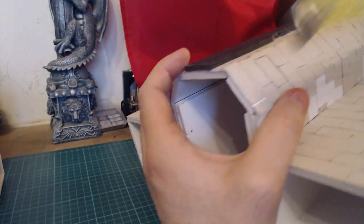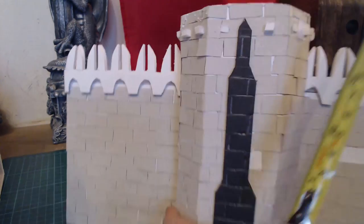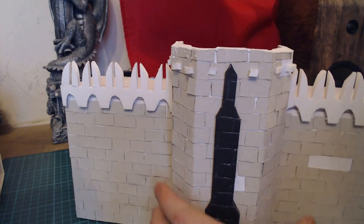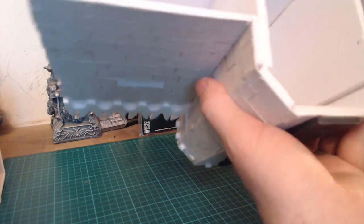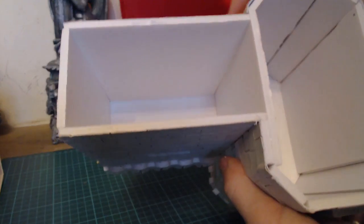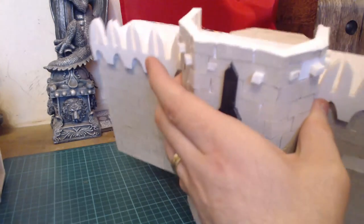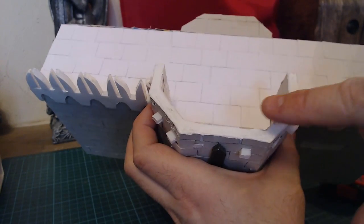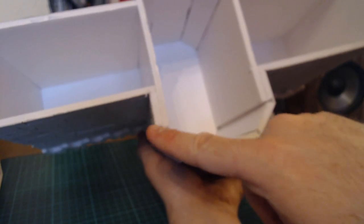Now the front has a lip on it, so front pieces are actually 8 inches high, so you just make it pretty much the same as the back, 8 inches, so it comes up over. Whereas the back was attached underneath, this goes over the front of it. And then I just used filler, because you'd have nasty gaps, just to fill in the top.